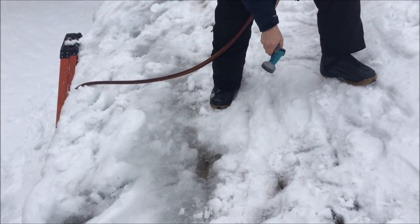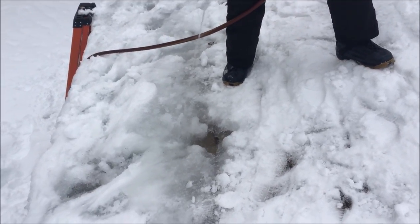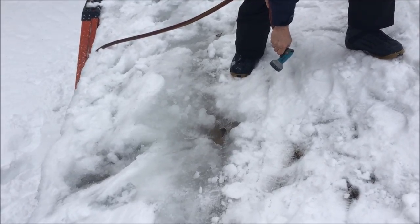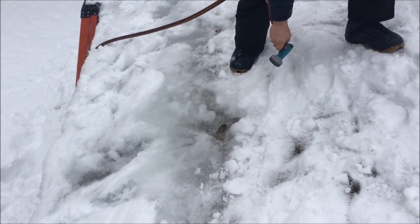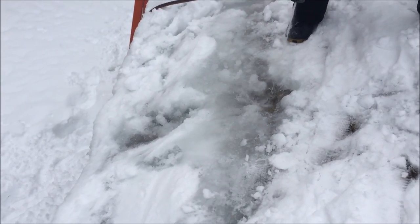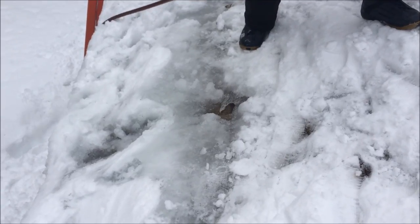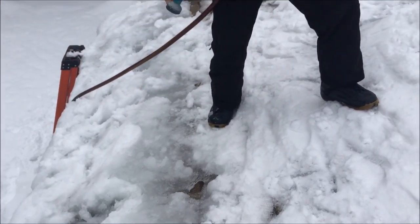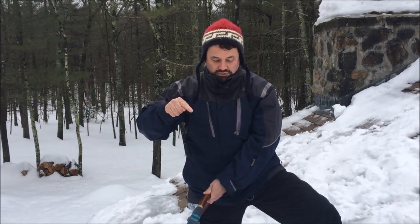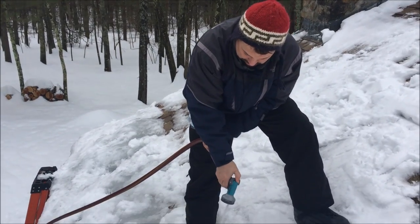If it's still leaking it's a pain, but I put the hot water hose here and I make a path, and this will stop all my leaks. But this water can't just sit here like that. What I have to do is drain it — see how it's starting to drain? All that water that was puddling, in just a couple of minutes you're going to see it drain away. See how it all goes right down? You can see it going down this other one too. If you see puddling, that's where it's going to follow the nail right down to the insulation and into your roof.